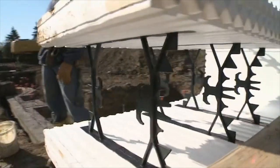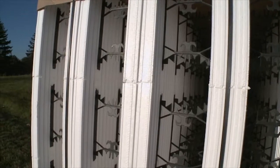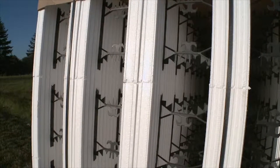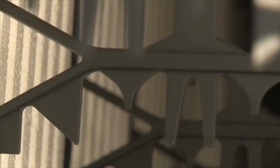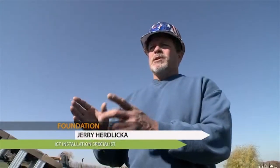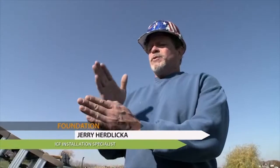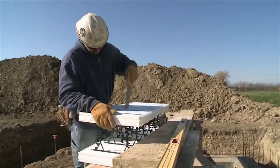The insulated concrete forms are two sides of insulated styrofoam. On every eight inches, there's a nailer that holds from front to back on the styrofoam form that makes up the insulated concrete form itself. On the blocks, the ICF insulated concrete forms, they're not only between the black tabs — which are the nailers — but there are one-inch increments in between as well. You have to cut on the one-inch increments to keep your black lines all in a row.